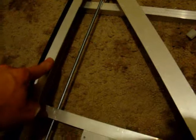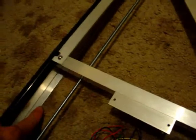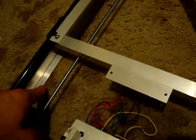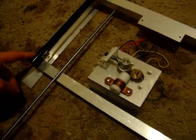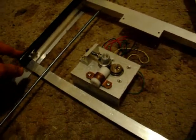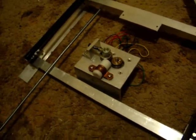They'll be constrained at this point, so it'll be screwed from here and will go down onto this arm in here to constrain the movement, so it doesn't wobble back and forwards. Even though with the 65 bearing along here it's constrained at that point, it needs two points to constrain so that it doesn't give too much error.